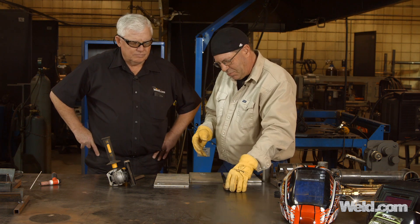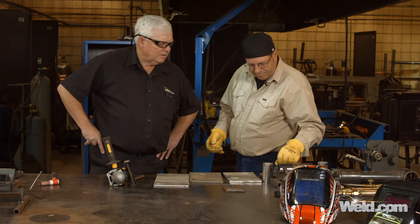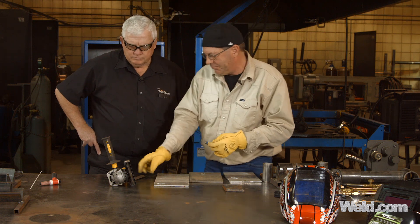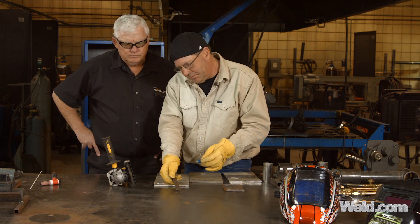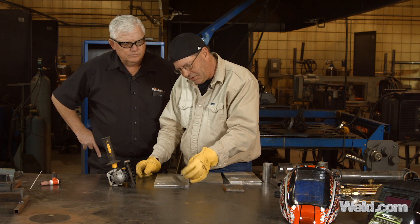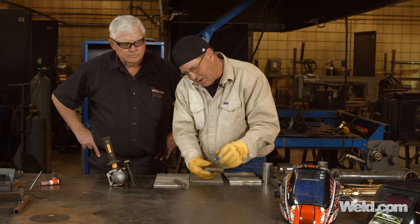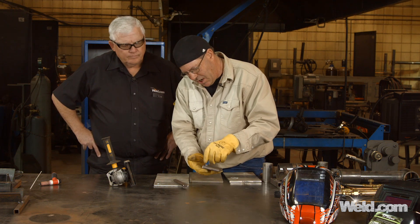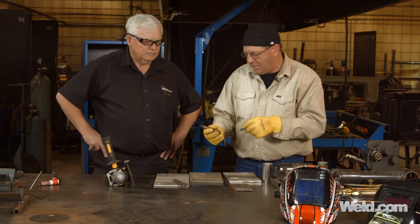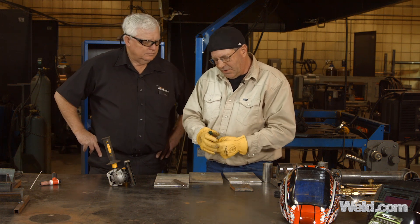It's interesting when you get into pieces of carbon steel and what they're alloyed with. Another simple test is a plain old magnet — carbon steel is magnetized, so we're picking this thing up, pretty good size. Cast iron — magnetized, but this piece is kind of heavy, definitely magnetized.